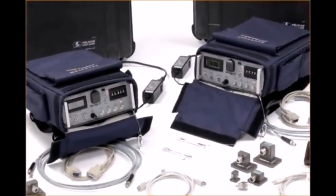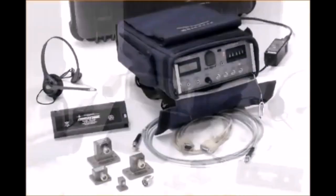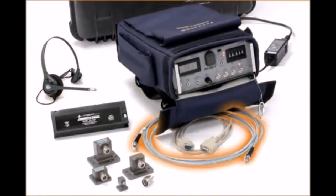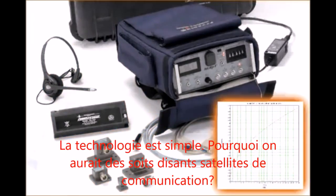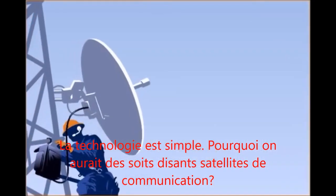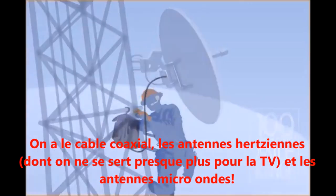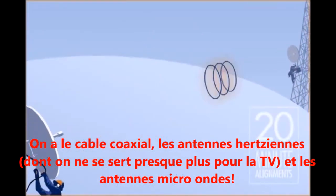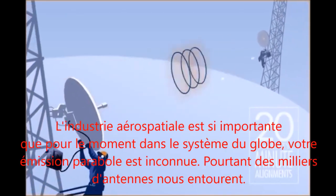Powered tunable transceivers that you connect directly to the antennas. In addition to the units, the set contains backpacks, headsets, coax cables, adapters, batteries, and a path loss calculator. That means you can perform alignments up to a range of 100 miles, even before the radios or power are available. Alignment is quick — usually 20 minutes or less.